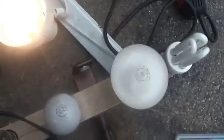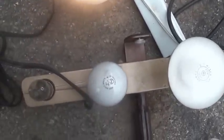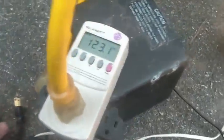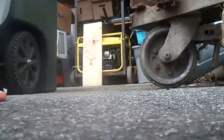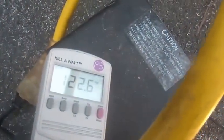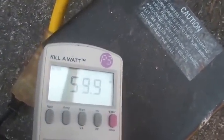This is a much heavier load obviously — I'll plug it in, try not to electrocute myself. I don't know if you could see the lights come on, but 122.6 volts and once again the frequency is bulletproof. It's got to be electronically controlled, not governor controlled.